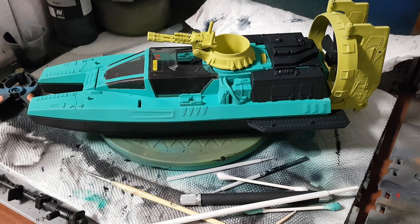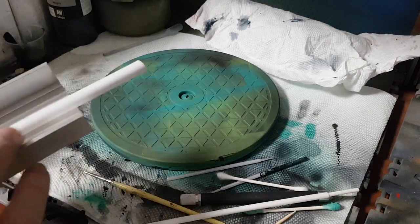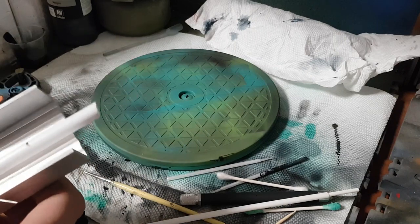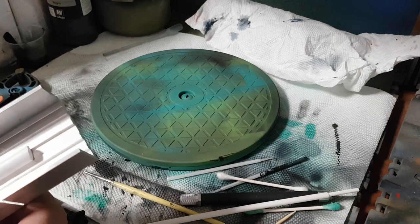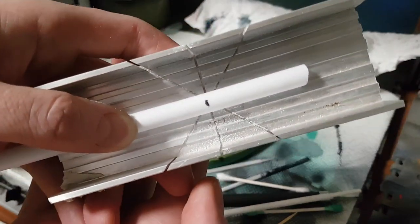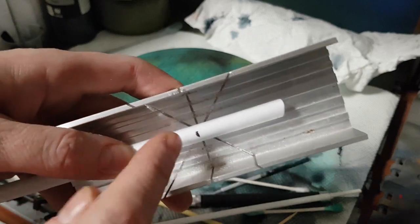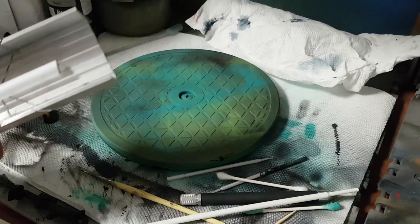I want it to come to about there. Now I'm going to put that inside the miter box and prepare to cut it. I'm trying a different angle here because I'll need both hands up close. I'm gripping the miter box and holding the styrene rod in place with my thumb. My mark is down the center of that channel where the saw is going to go.